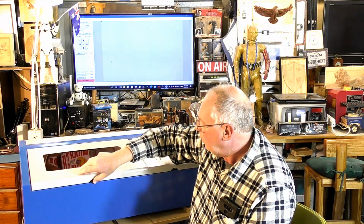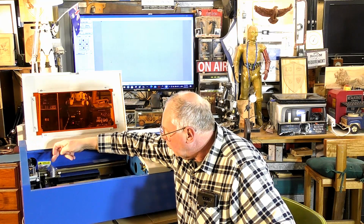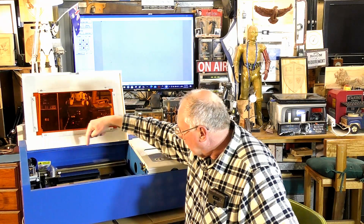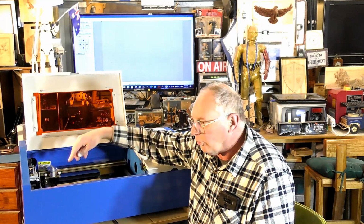So to do that is just measure from a repeatable point, the top of the screw actually, to this back wall, here and here, and then do the same with the glass tube. And if there's any variation with the tube, you know it's not running parallel, so you have to get that parallel first. And of course I found out the reason why that occurred was because the 2 nuts that I found in the bottom here when I first unpacked it were off the bracket that holds the end of the tube here. So watch out for that one.